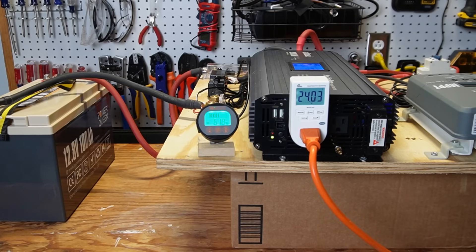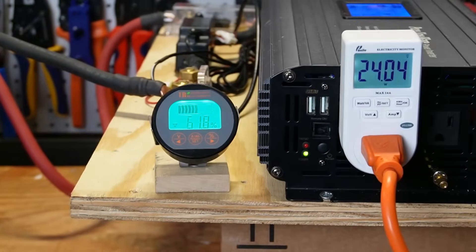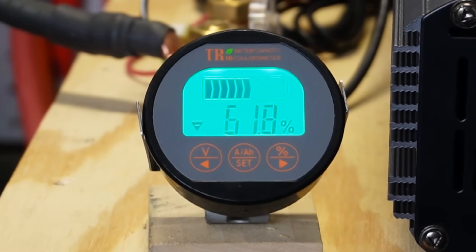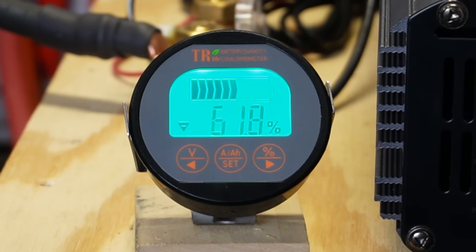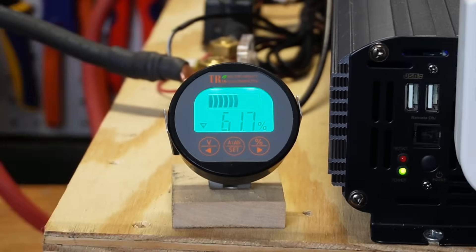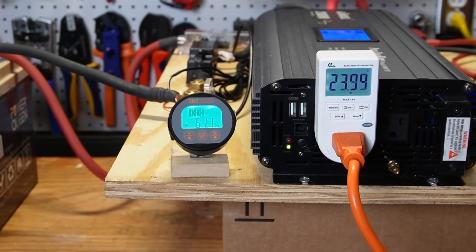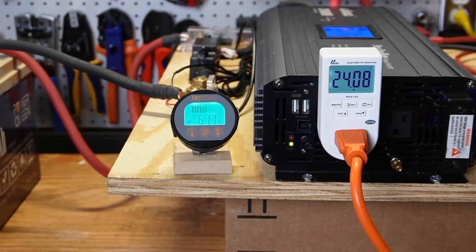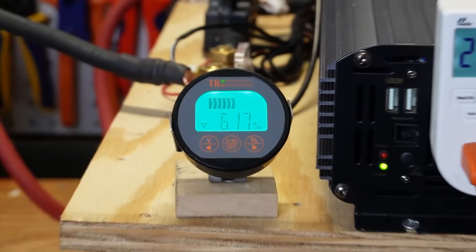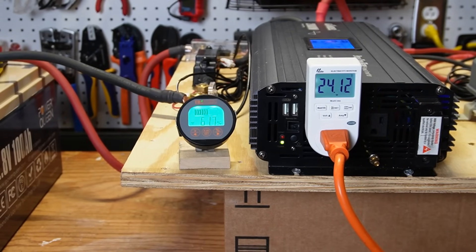It's later in the day, about 2:30, and the sun has gone behind the trees mostly, so we are no longer charging the battery. It's at 61.8% now — I did see it get up to 63%. So all a single panel could do was bring it from 35% to 63%, and that's just not enough. The battery used 65% overnight, and since we only got to 63% today, it will not make it through the night. So I'm going to add a second panel, still with one battery. I'll let this run down to about 35%, unplug the freezer, plug it into the grid, and in the morning with the second panel added, we'll start off with two panels and 35% battery.